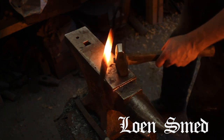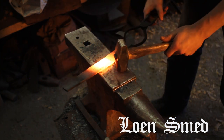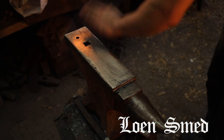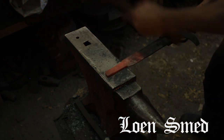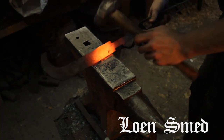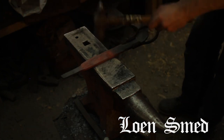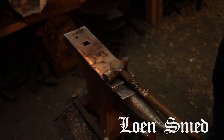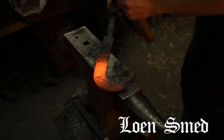I'm also working my way down the length of the knife, forging it down a bit so that as I'm forging down the edge, it doesn't get too proportionally wide. And I'm also going in and starting to define the tang. You'll often see me work like this, sort of taking the heat and working my way with it through the material from one end to the other instead of jumping around from opposite ends. I feel that basically makes it a little bit easier and quicker to heat it up and to keep productivity at a mile high, as it were.